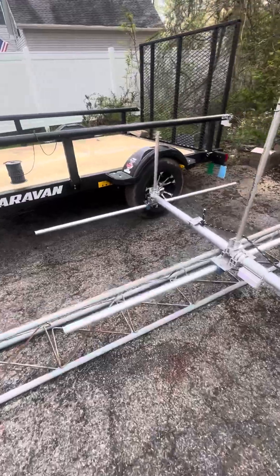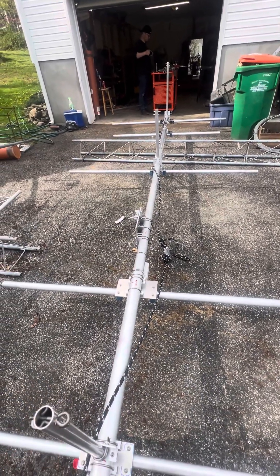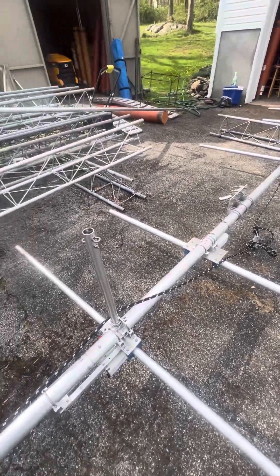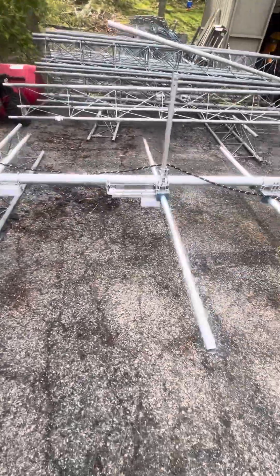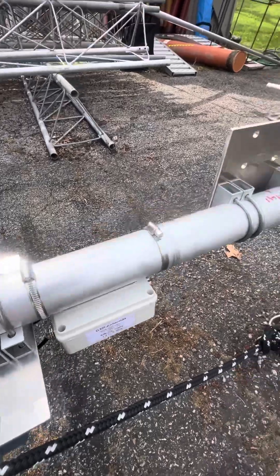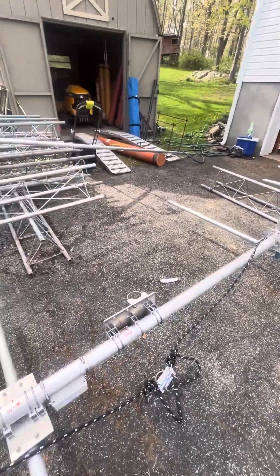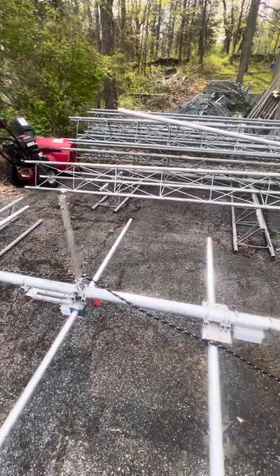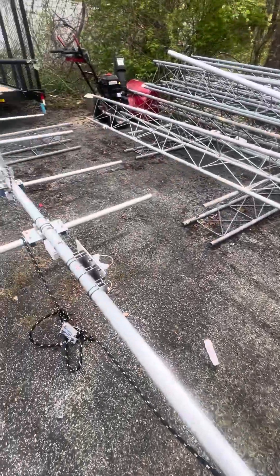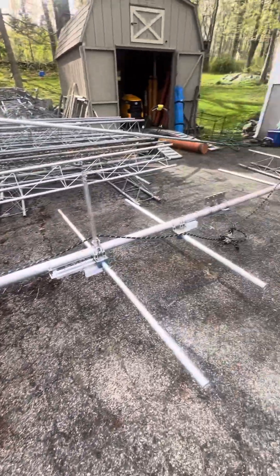The only thing you have to worry about with an antenna like this on digital modes is the trap — there is a trap on this antenna, basically for 17 meters I think — but we've never had an issue with a trap on any of these antennas, and we've had several in the air for many years. The aluminum is very thick but not heavy. The mast plate is thick. This antenna probably weighs 100 pounds, but keep in mind you're getting two elements on 40, two on 30, plus three elements on 10, 12, 15, 17, and 20. This is a fantastic option with no moving parts to worry about. Thanks for watching — Ray, W2RE.